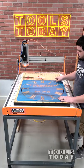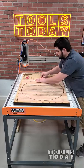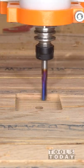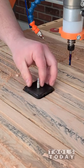So we went all the way through the material, leaving tabs so that we could flip this over. Using the fence for the workholding wasteboard — we do have the plans available for that on our website — we're able to get that easily flipped over and cut the backside pocket out for the clock movement, so we can get that inserted there, and it does fit.